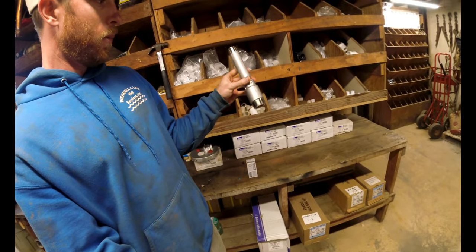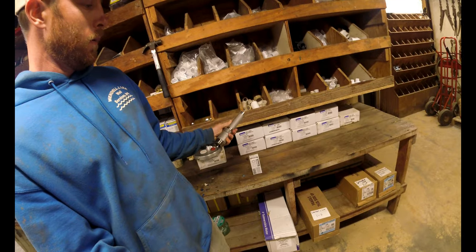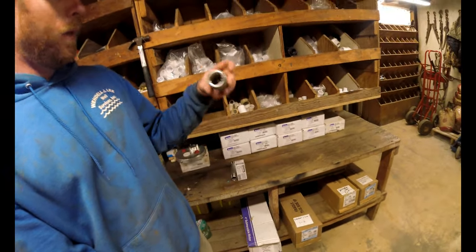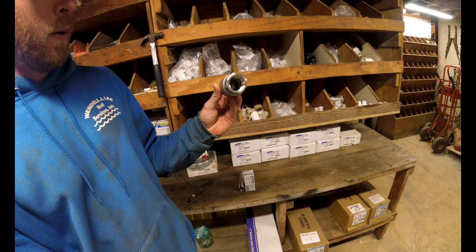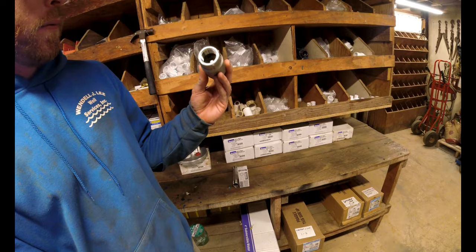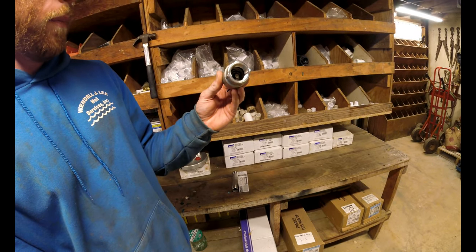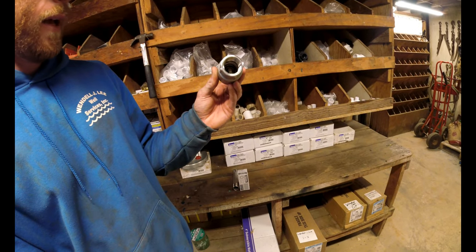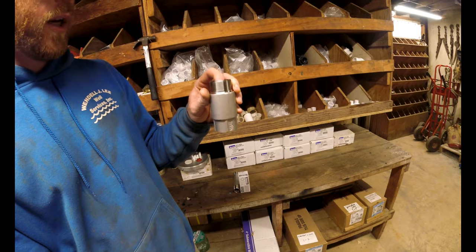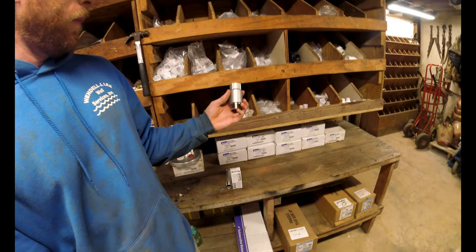They are dependent upon flow direction — there's an arrow on it telling you which way the flow has to go. The upstream side looks like this. When water comes in, the little valve goes open, and when the pump stops pumping water, it goes back down. You can hear that little noise — it's got a spring in there that pulls it back down.